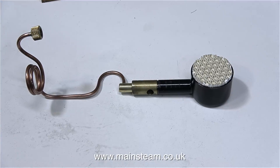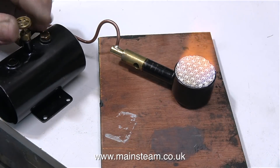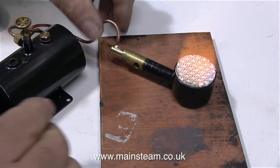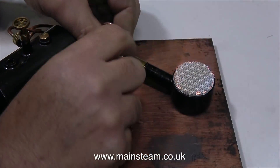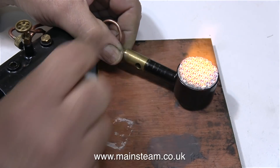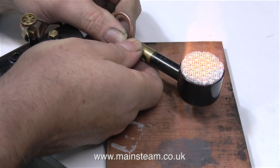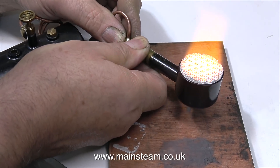I left the paint to dry and bent the pipe to fit the burner. This pipe is a commercial item and it has a special fitting with an O-ring at the gas tank end. With these Bix burners, it's really important to read the instructions. The gas jet — in this case it's a number 8 gas jet — needs to be in exactly the right position in the venturi pipe. Too far forward, you get a very yellow, sooty flame. Too far back, the burner is likely to overheat. It's very important to thoroughly read the instructions and understand how you set them up.